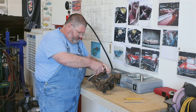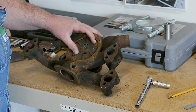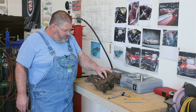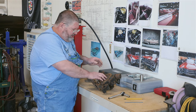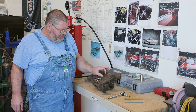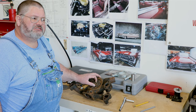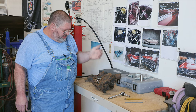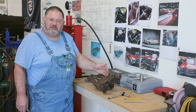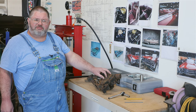Once we get the cover off, we need to get this impeller off the shaft. There's a spring-loaded seal behind it. We can push the impeller on the shaft a little bit more, and by pushing it in with the press, we can kind of break the rust free so it's easier to pull it off with our improvised puller. We don't have the special Cadillac tool that fits in here to pull. What I generally try to do is get some threads in here and pull it out with a steering wheel puller. Some of them come out easy, some of them don't. Worst case scenario, we don't use this shaft or this impeller — get in there with an angle grinder and go to town on it, as long as you don't damage the housing. Let's get this over into the press and push it in a little bit to try to break the rust free.